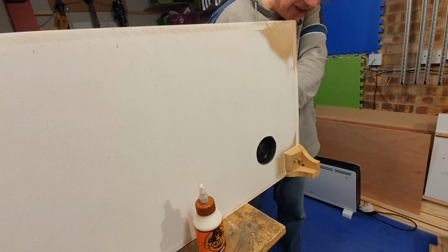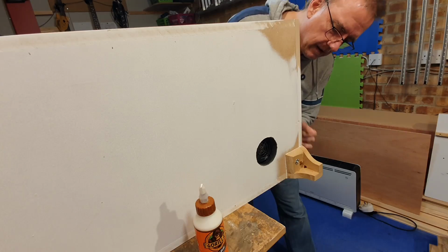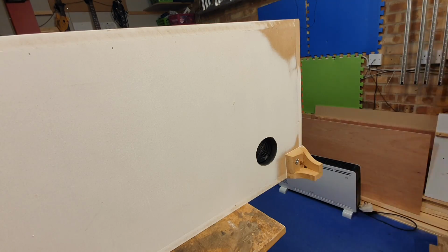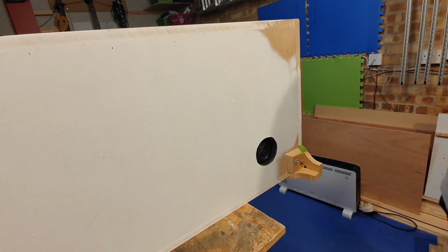The first clamp I use is the bolt from the inside. This would probably do a great job all by itself, but I also fling a sash clamp on there too. I just nicked a corner of that piece, a little glue and some painter's tape, and you'll never know.